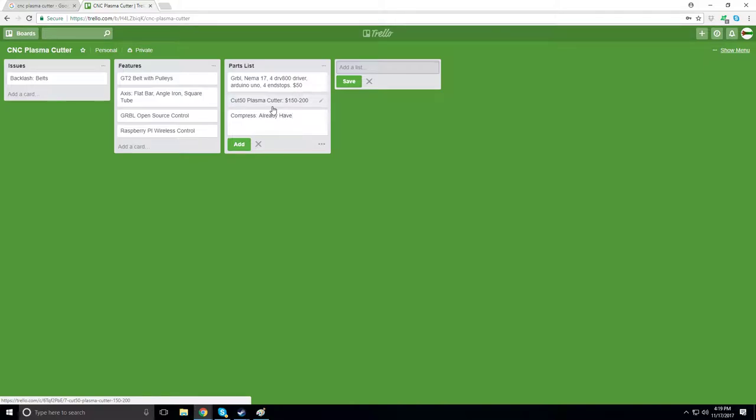The compressor is already available since it uses air as the support gas. We'll need to design everything in Fusion 360 to figure out the steel required, including the ribs. It probably won't use a water table. Since it's going to be in an enclosed space, I definitely want to capture the gases and filter them through a HEPA filter before depositing toward the ceiling and away from anyone breathing. I want a big suction chamber in the bottom where the gases get sucked through.